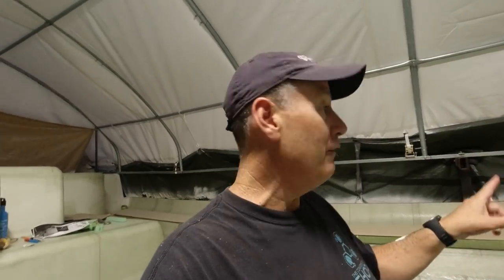I don't intend to just do the straight laminate of one layer of 600, a layer of 300, or the other way around, 300, then 600. I intend to then do another layer of 600 over the complex curves around the top here, and particularly around these window mullions. They have to be reinforced and beefed up. So I'm thinking about strength and reinforcement, but only in small areas where I can certainly cut down weight.